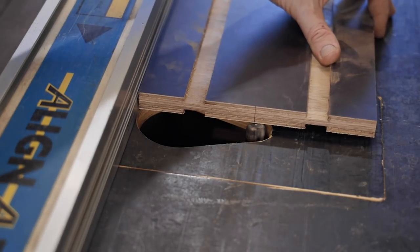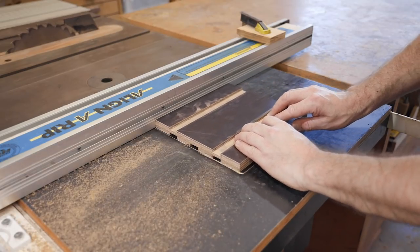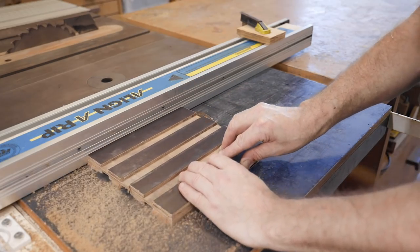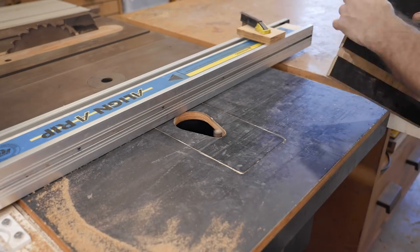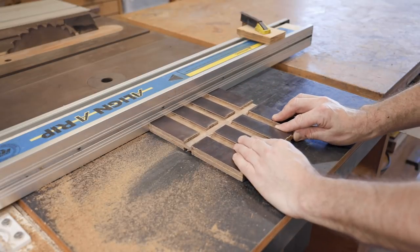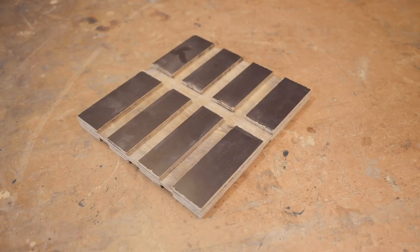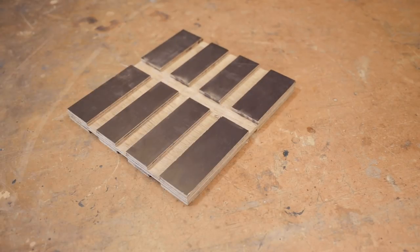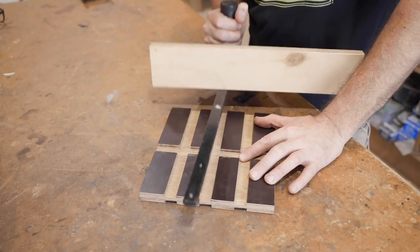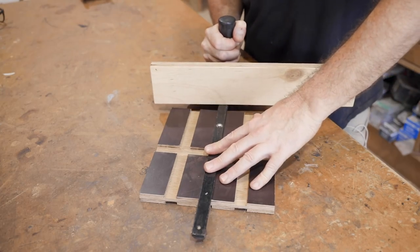Now I'll make one in the centre — that's for the 90 degree setting but it doesn't need to be exact. Next I turn it 90 degrees and make another dado in the opposite direction. It would be a good idea to make a test first before you go cutting all those dados — we want a nice fit. We don't want any sideways wobble, we don't want it to be sloppy, and that's perfect.